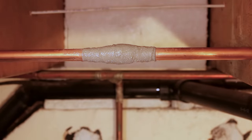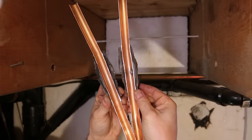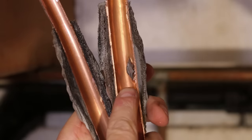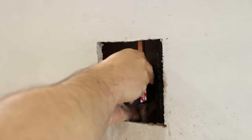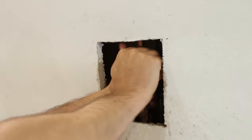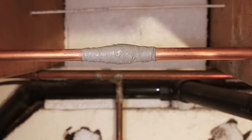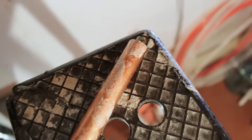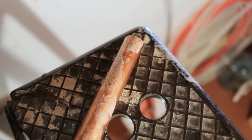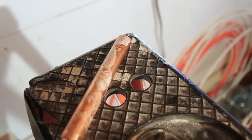This kit is great for doing its job, but it's made with harsh chemicals such as the epoxy used to bond everything together, which will come in contact with the water inside the pipe. Unlike other pipe repair kits, this one won't work if any water is leaking from the pipe, so you'll need to shut off the water first. It can also get messy and, if left untouched, could harden and be really hard to remove. This temporary fix is not code and should be removed promptly for a proper fix.